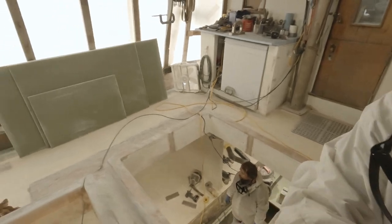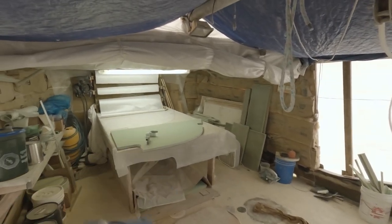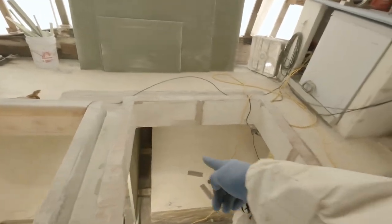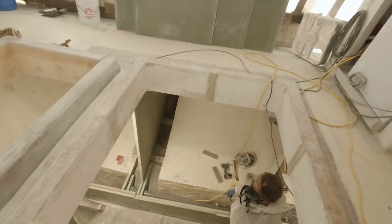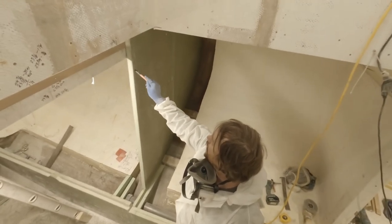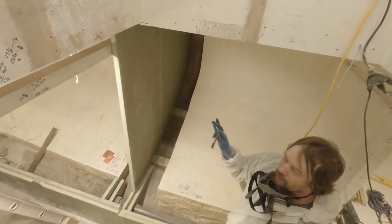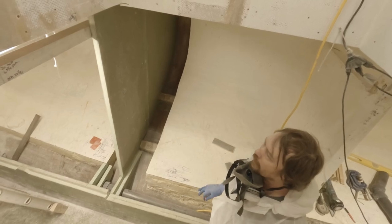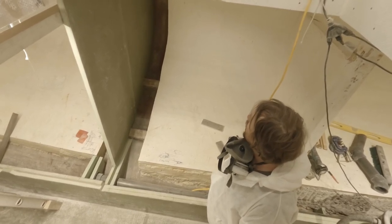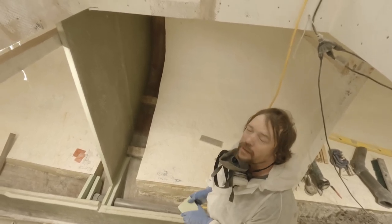And a minute ago, I cut up the pieces to laminate one side. We're just going to do a layer of mat and a layer of 45 to stick the two halves together. There's already a full layup of thickness on that side. Both sides of the existing pieces are already laminated, so we'll just add another layer of chop strand to that one. That'll help bind it really well to the foam, and then just a layer of 45 to glue it all together, add one more layer of rigidity and toughness in there, and we should be good. So we'll laminate that, and then I guess scoop the hole side, I think? Would probably be easiest. I think that'd be best.